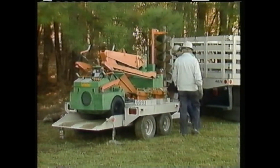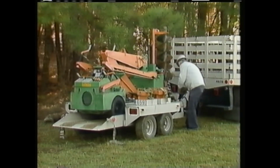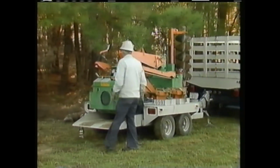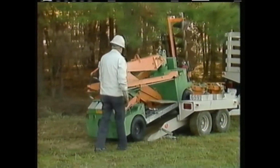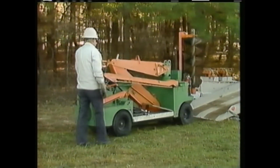When holes are dug for pole installation, all locations may not be accessible to a digger derrick or other truck-mounted digging equipment. In these cases, a smaller, portable power hole digger may be used. Farther along the feeder line being installed, several of the poles will have to be set in areas where the digger derrick won't fit. A portable power digger is available and will be used instead. The crewman realizes that the diameter of the auger on the portable unit is smaller than needed to dig the holes. He'll dig the basic hole with the auger and then enlarge it to the right size using manual digging tools.